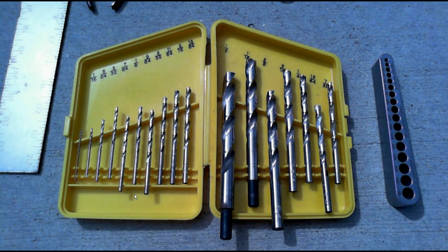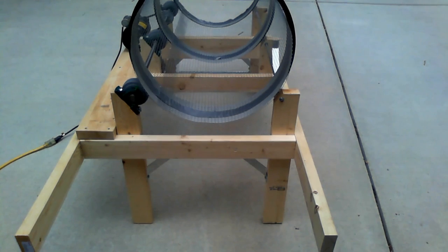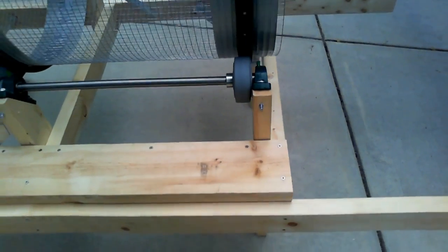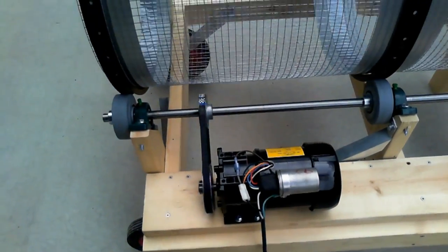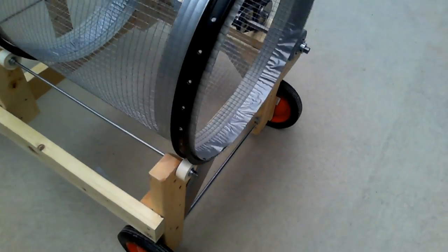I used the real small drill to create pilot holes. This is called the big gator tool, and what it allows you to do is take a drill and put it in the properly sized hole so you can drill a perpendicular hole. That's important when it comes to drilling the holes for the idle wheels. The build challenge for this trommel design is coming up with perfect contact between the trommel drum and the drive wheels and idle wheels. As you watch this video, you'll notice that the drive wheels are making perfect contact with the drum, as well as the idle wheels fitting perfectly aligned within the bike rim.